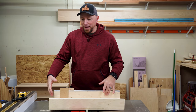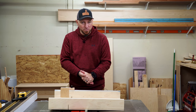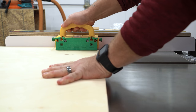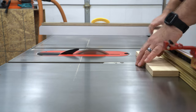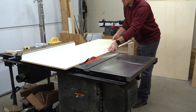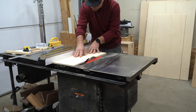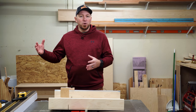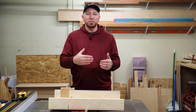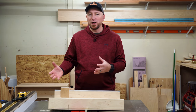I'm going to make my specific jig out of half inch and three quarter inch Baltic birch plywood — technically 12 millimeters by 18 millimeters, but we'll just say half inch and three quarter. I'm starting off with the three quarter inch material for the fences. I cut two pieces both at 24 inches long by 3 inches wide and set them aside. There are two layers to the base of this sled, but the first layer is half inch material. I cut this piece to 24 inches by 10 and 3 eighths. This will be the overall footprint of the sled, and the extra depth will give me plenty of room to work, while the extra length allows me to use the sled on either miter slot.